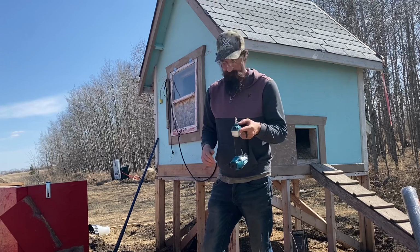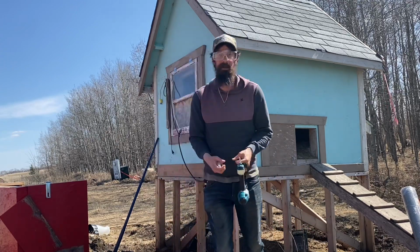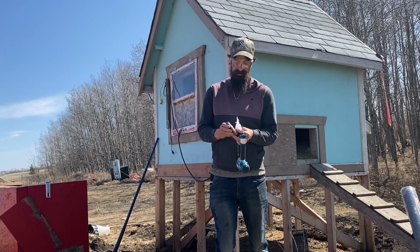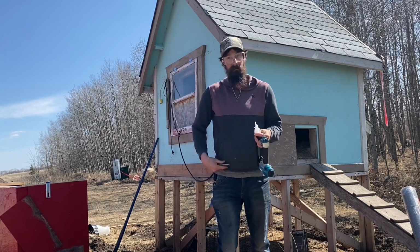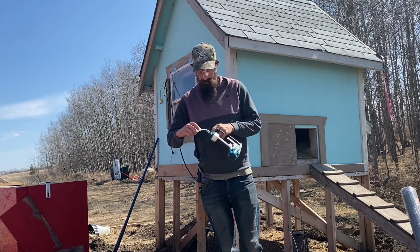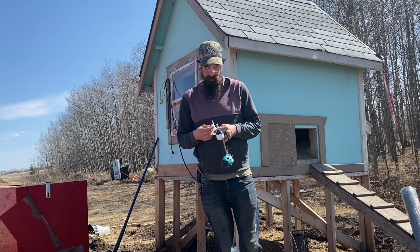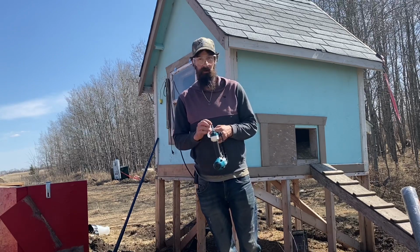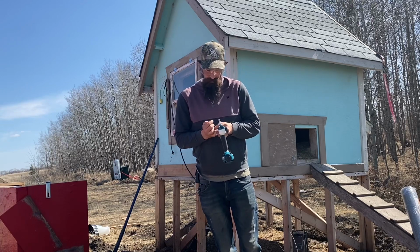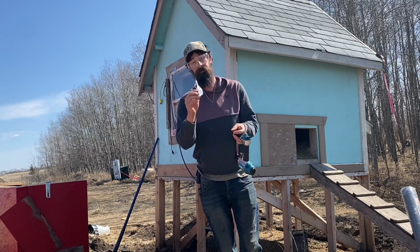But never forget to oil these things when you first buy them. Makita of course comes with some tool oil, and I'd never cut this open prior to making this video, so we'll just get the Leatherman out here. Here we go, we're going to oil her up. A couple drops will do. You're just trying to keep those O-rings lubed up so the tool keeps going for you. And Makita includes a nice cap on there so it doesn't leak.